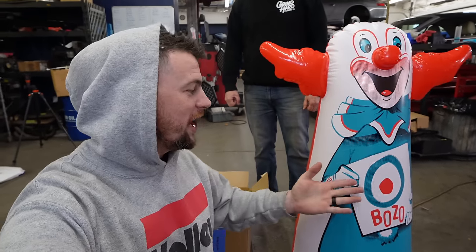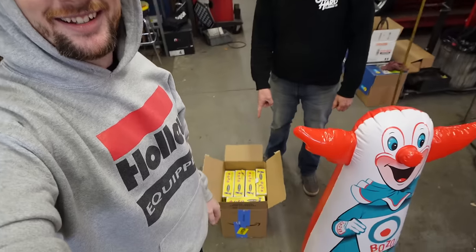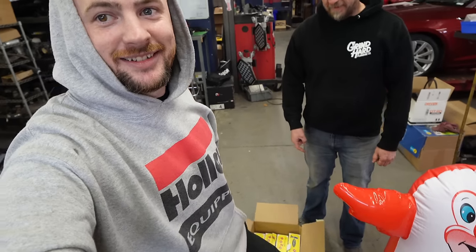Today's Tony's birthday. For the body-building process, we wanted to get some half-inch 6005 T5 aluminum tubing, but we couldn't find any. So we got some 6061 T6 aluminum — rather than buy a whole bunch and find out we can't bend it, we bought just one tube to test. Our aluminum rear trailing arms are also on their way so we can move forward on the rear suspension.